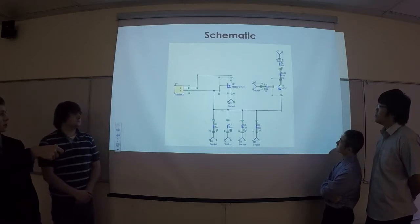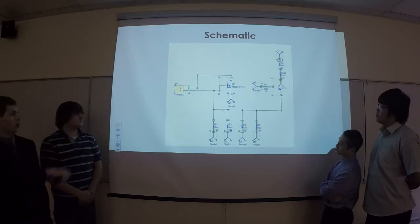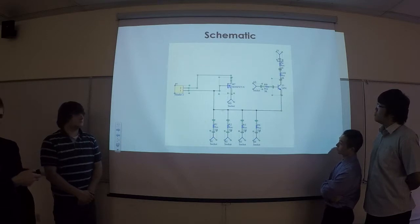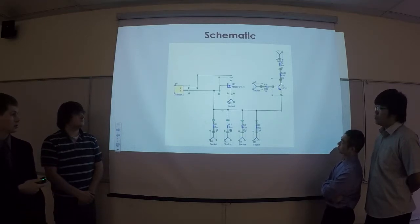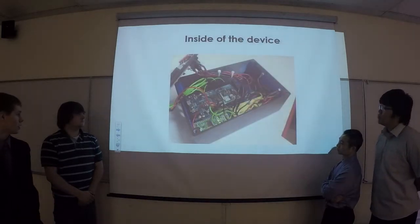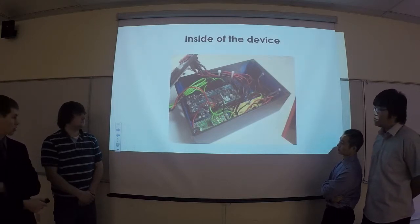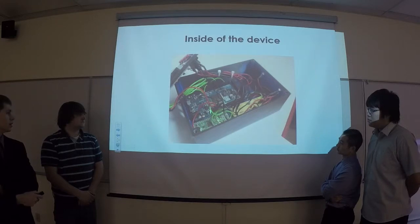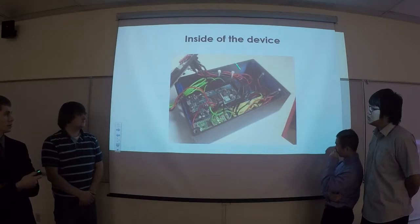And here we have a transistor and our Arduino signal right here. I'll go through the resistors. Our resistor values are anything less than 4K for RB and about 22 ohms for RA, just to get our transistor to saturate. Here is the SpeakUp, which is the voice recognition part of our project, and that takes a signal and goes into the Arduino, which ties into the infrared code. And here's the PCB board that ties into the buttons up here.